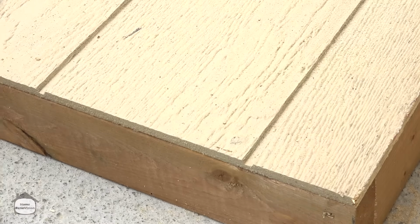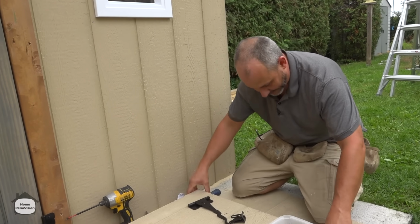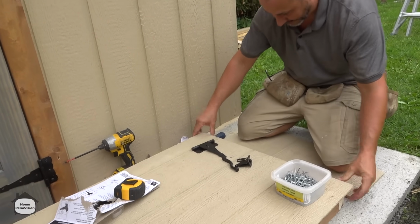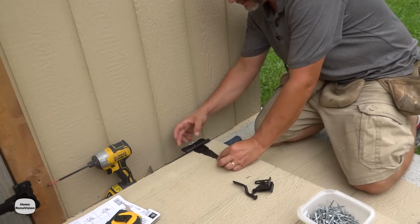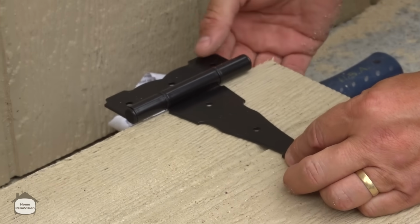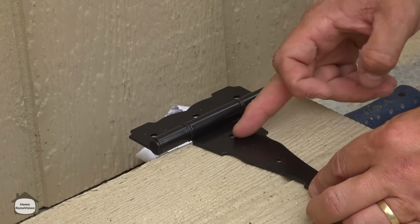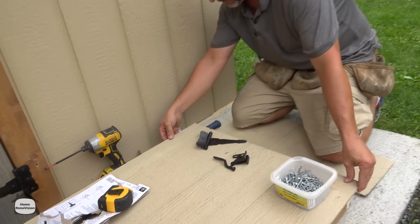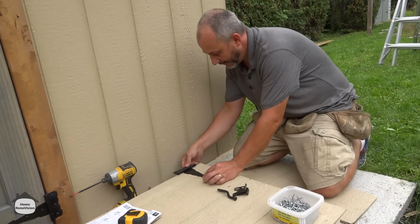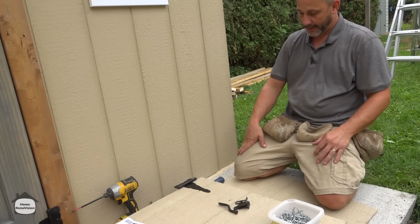I'm gonna nail the hole straight side first. Try to keep this door as straight as possible. When you're building your own door, you really want to consider your hardware. There's so many options. Now remember, our hinge is gonna go like this, the middle of the pin on the cut line. So regardless, we're going to have lots of wood right up to the first screw. So I can actually have an overhang of this material past my door frame of 3/8 of an inch. And that'll still allow that screw to find the door frame, which is awesome.